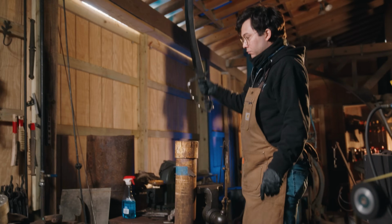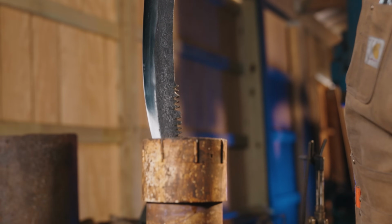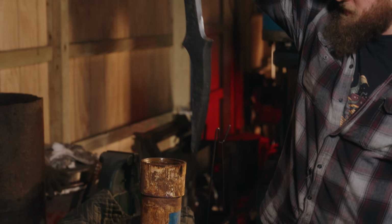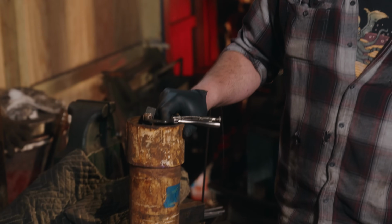Now that the blades have been ground and polished, it's time for the acid. We use ferric chloride to etch the surface. It's going to show us the core steels and then the beauty of the wrought iron that's clad to the outsides. Both teams have decided to kind of make the same construction here, but the blades will look very different.